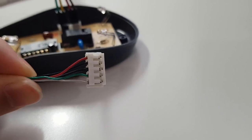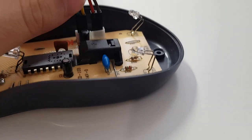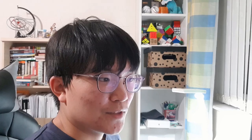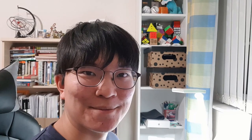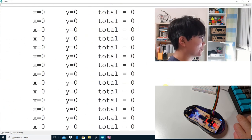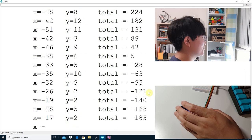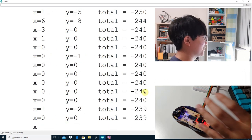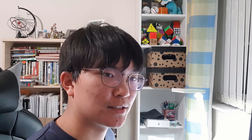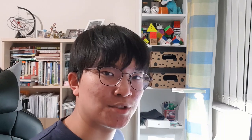The color codes should be on screen. One thing about this though is that you probably don't need a shield — it's not necessary, so I just didn't wire it. And now the code. That took quite some time. But now if I go into the program, you'll see it outputs a stream of x and y values, and as soon as I move the mouse it'll output the corresponding values. The main thing here are the total values, which are calculated as a sum of the x values, and I can basically set a condition if that total exceeds a certain amount.